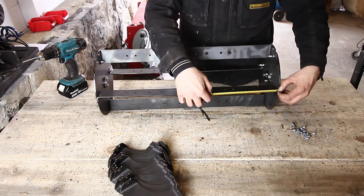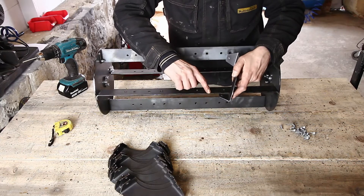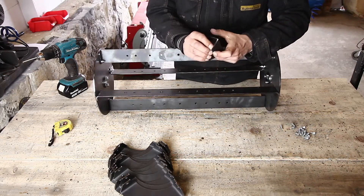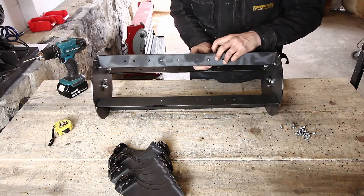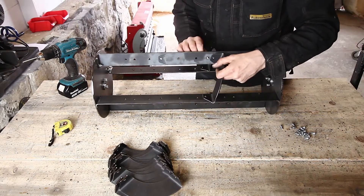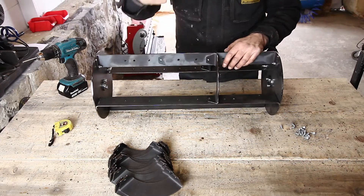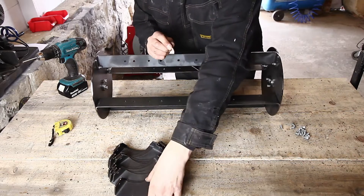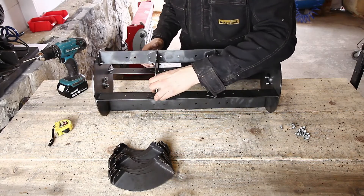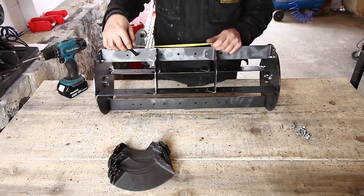So let's say we want the spacing of 20 — it's here. Because of this little flange, we're going to use the next hole to the right, so it's going to go like this. I recommend if you're right-handed, you first take the screw and put it in, then just put it inside. You can notice that one of those holes has a thread and the other one doesn't. Each segment is connected to the other one, and in the end it forms sort of like a serpent that bites its own tail — I really like that idea. So we take the screw in.